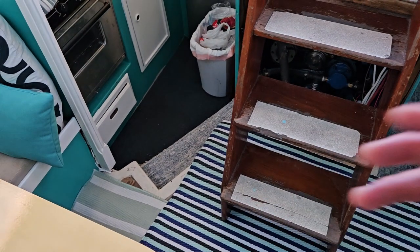These ones were neglected a bit, and so what I found was they were completely dry. Whenever I checked each cell, which they had individual cells, each compartment was completely dry, and the batteries were actually swelling, which is really bad. They're still kind of holding a charge, but if I drop a heavy load on them, they're dropping charge, and that should not be happening.